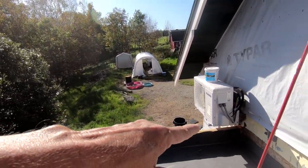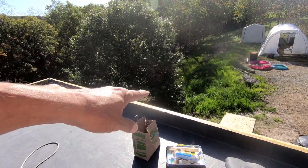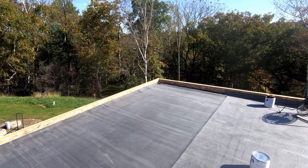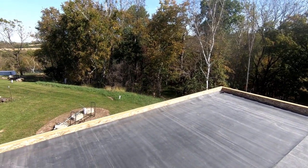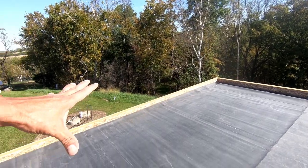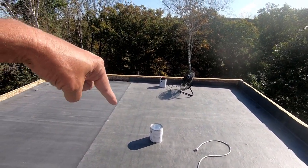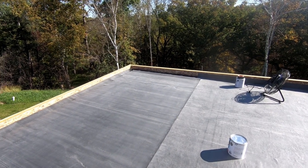Whenever I get these corners and stuff done, I'll be running the termination bar right below there. So it will actually be cut off right at the top of the termination bar, which will be just below where it is now. Then this is getting a cap on it all the way around for the winter — a treated wood cap. And the final product will be a deck board all the way around, a trim board. Then this will have a deck that is roughly 30-inch squares with the patterns going opposing — every other one is opposing. I think it's herringbone.